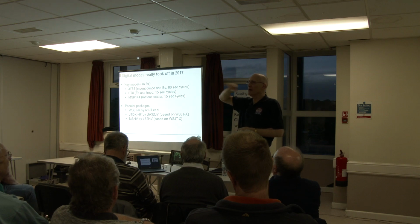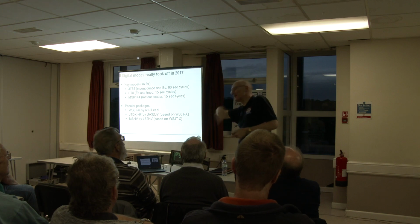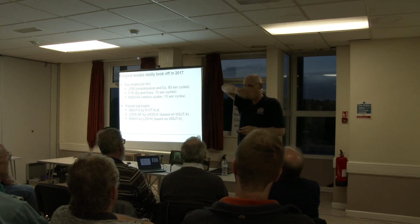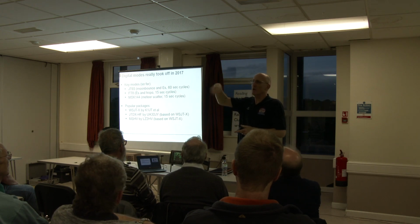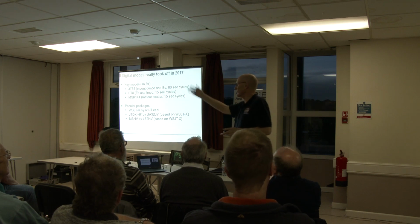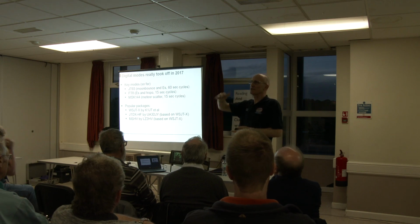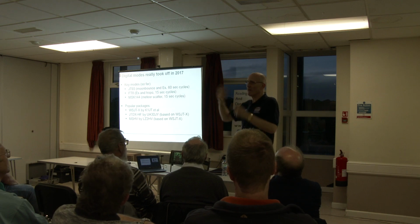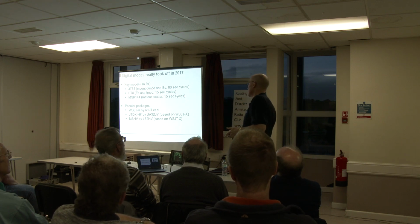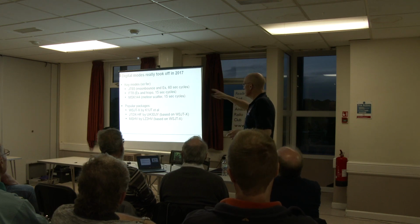And in fact, there's a whole other topic that I could talk about: polarisation effects in sporadic E. It's rotating quite fast, and when I say quite fast, I mean on a timescale between seconds and minutes. And so signals can be very unstable. Hence, something quicker like FT8 is better, particularly for sporadic E, and that's what it was developed for.